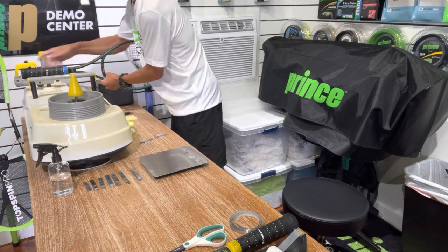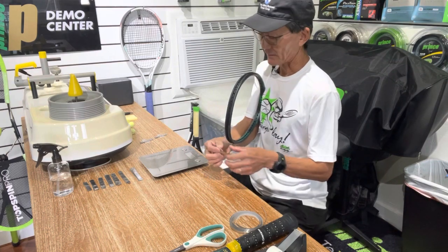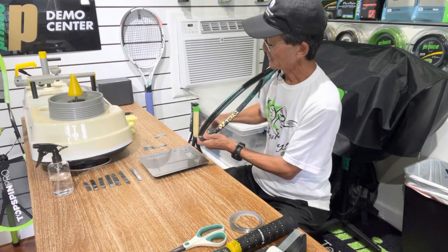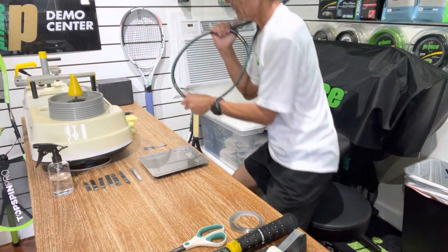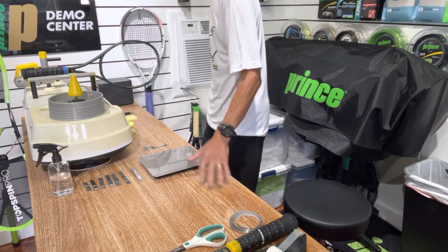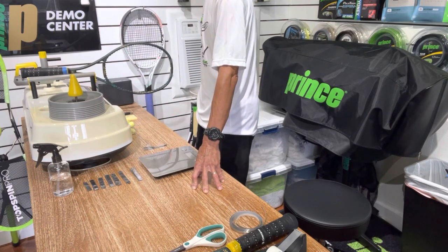We're at 305. I want to get it right at 307, so I'm going to take this off and try five inches. I have a couple of pieces already cut — I have these in two halves — so I'm just going to put two two-and-a-half-inch pieces right from the center going down. It's right at 307, but I'll take a couple of readings just to make sure the average of three tests comes out to 307.